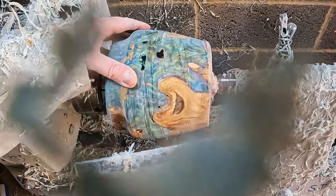So the lesson learned here is that I should have primed the timber with clear epoxy and allowed that to soak in and cure before doing the main casting. This would have sealed the surface, trapping the air in the wood.